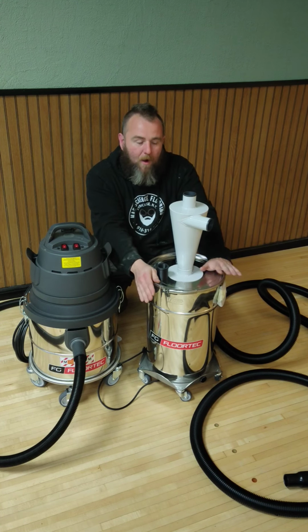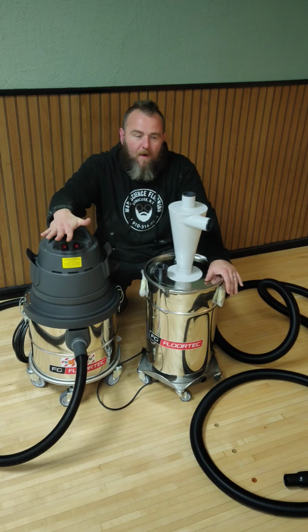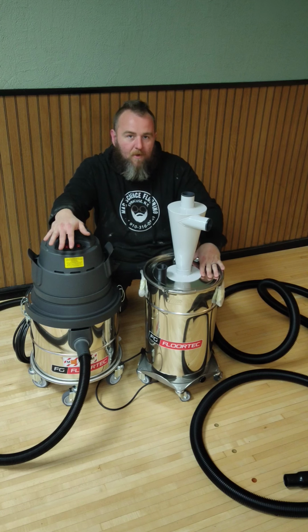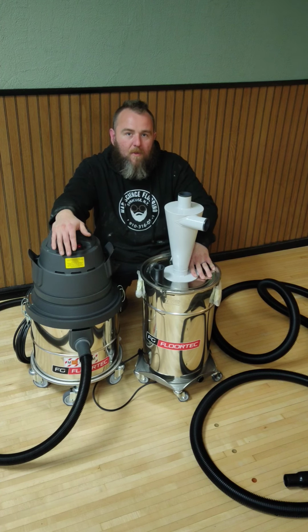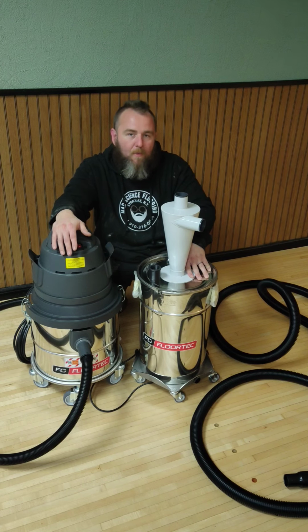One of the biggest problems that we have with new guys running their aspirators is they tell me that the filter wads up. Anytime that the filter is wadding up in this machine and your Cyclone is not full, the reason for that is you have a leak in your system somewhere, and I will tell people until I am blue in the face that they have a leak in their system somewhere. Every single time it resolves the problem. Once they seal their Cyclones, they get little to no bypass, 99%+.